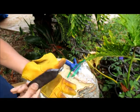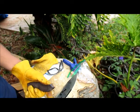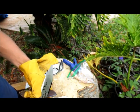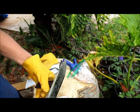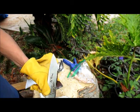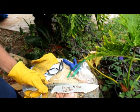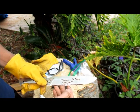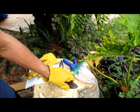I find that with this piece of wood alone, anyone should be able to test most of it. If you're a regular person and you have an edge, and you whittle this thing, it will tell you how strong and how stable your edge really is. If the heat treat is soft or burned from grinding, then you can either chip, if it's brittle, or if it's soft, then it rolls, and you can feel it. So that is African blackwood.